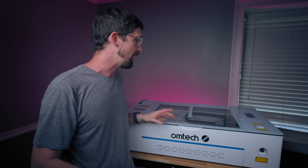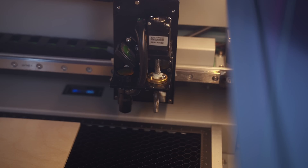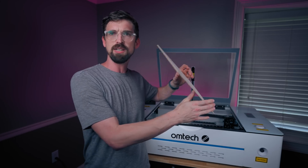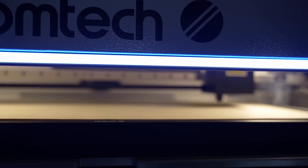But I also find companies will say 'autofocus' when they really mean you can set the focus inside the software. The OhmTech Polar is a good example — it's actually a great unit, but they list it as autofocus, and it's not autofocus in the sense that you hit a button and it focuses itself. What it does is the laser head can move up and down via a Z-axis motor, and inside LightBurn you set the material thickness. LightBurn has an offset — basically the distance from the top of the honeycomb bed to the laser head. So if I use 3mm plywood with an offset of 17mm, minus three gives me 14mm, which I put into LightBurn. The 'auto' part just means it moves the head to the right position after homing. It's not a massive deal but can be confusing.